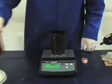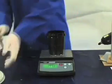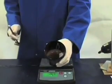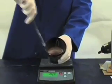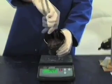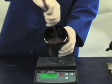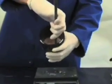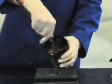Now we have the catalyst — add a little bit at a time just to make sure we get the right amount. If you put too much in it will go off too quickly; if you don't put enough in it will take too long to set. You can see it's very thin on top — the catalyst is much thinner than the actual silicone itself. So we have to be very careful when we're stirring it in at first; it's almost folding the top layer of liquid into the thicker layer underneath. Making sure that we scrape the sides — it's very important because it's so thick it clings to the sides, and we need to scrape that away so it mixes in thoroughly.